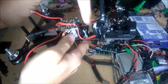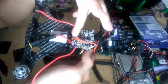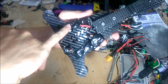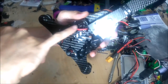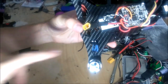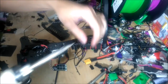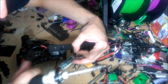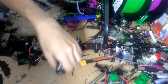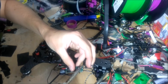At this point I've remounted the tilt mechanism, put the servo on, and secured it with trusty old cable ties. I've flashed Clean Flight onto this now and set it to Tricopter mode. You can see when I wiggle the yaw, it does wiggle the motor — so that's good. I've put these BL-40 ESCs underneath and soldered them in, secured with good old gaffer tape rather than heat shrink, but they're kind of underneath there, which is neat. I'm just soldering on this last ESC now — there's been a lot of wire extending going on. And of course it's spinning the wrong way, so I've got to swap the leads on this one.